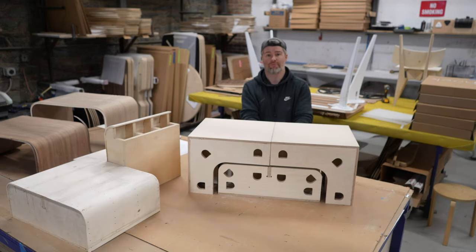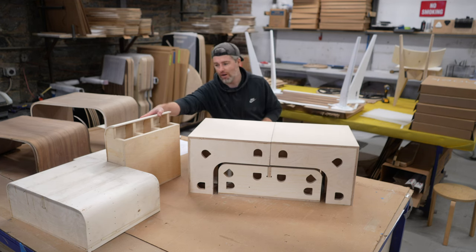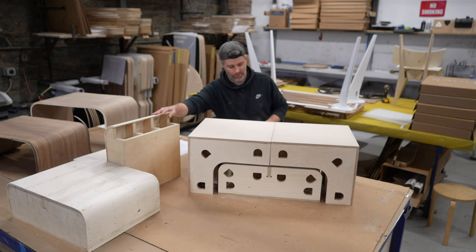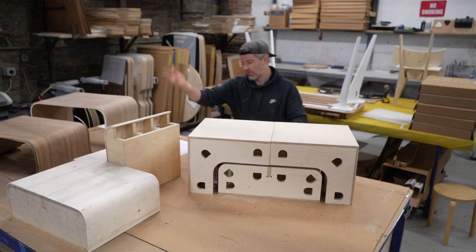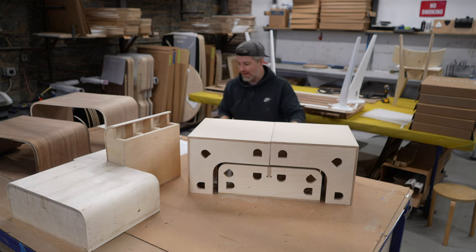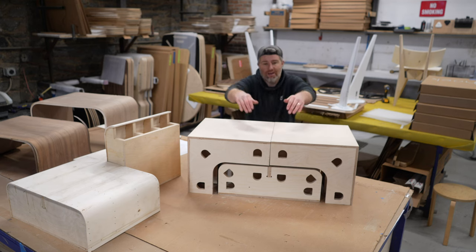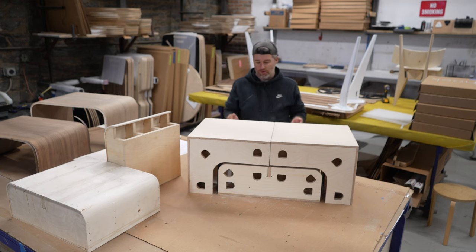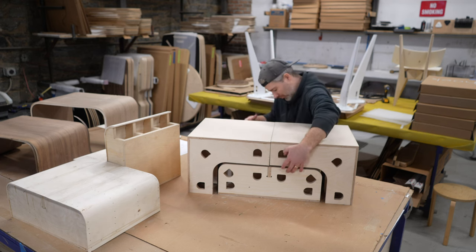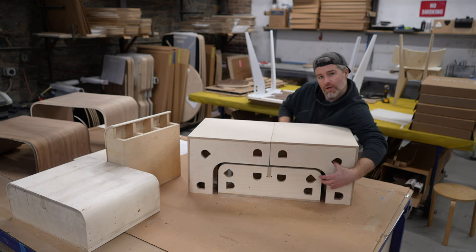This is version 2 of the jig, and this takes into account all of the lessons we learned from the mistakes with the first one. So it's made as a three-part mold as opposed to retroactively cutting it in half. It's more accurate, and I knew it was gonna be a three-part mold to begin with. Now I've added all of these holes on the sides. What that is for is to allow us to get smaller clamps from here to here, here to here.